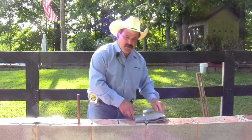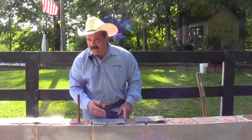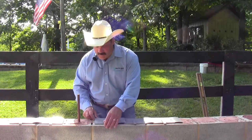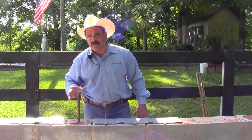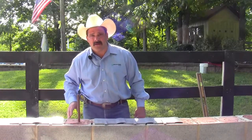It's very important that you don't extend your tabs over the face of the wall, even a little bit, because that can create a leak on the back side of the wall. Once these are in place, we'll go ahead and spread some mortar. It's very important to cross-web your mortar at your grouted cells, so that you hold any grout that comes in when it's wet from pouring — either left or right onto your spouts.